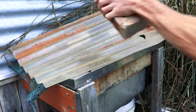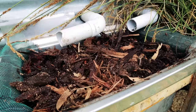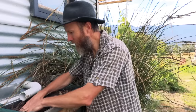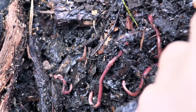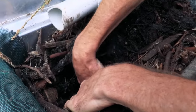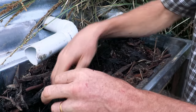Under here I've just got a worm farm — we've got quite a coarse medium and that's basically acting as the first filter, and the water's just passing through there. We pour down rinse water and stuff like that that might have rice or salads, and it all gets caught in here and then the worms start eating it up. Every once in a while you have to check it, probably monthly, just to make sure that as you go further down it's still in that loose form where the water can travel through easily.